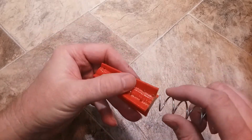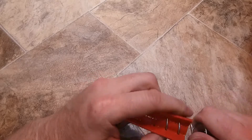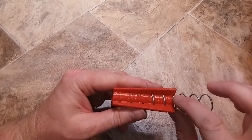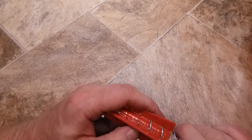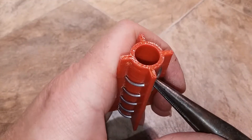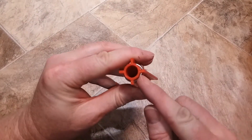Take the center of your FPV antenna and carefully twist the wire in. You may need to guide it with your thumb into the holes. I drilled these holes out at 2.6 millimeter. If you're having trouble getting the wire fed in, you may need to drill the holes bigger — 2.8 or even 3 millimeter. But if the surface of your ABS is nice and smooth, it should slip right in there. You can take a pair of needle nose and feed it through the holes.